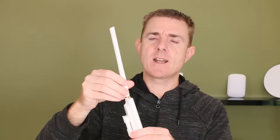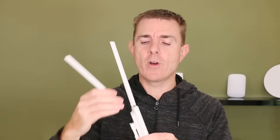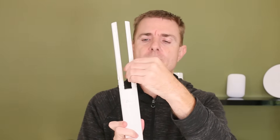This outdoor device runs in the 2.4 and 5 GHz bands. It's only got two antennas and two spatial streams — two by two — so it's not going to have massive capacity for lots of devices, but get a number of these outside and it will give you good coverage. The antennas have standard connectors, so you could fit a single larger omni antenna or some bigger paddles if you wanted a little more coverage and range.